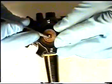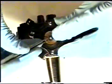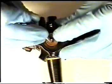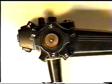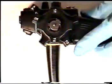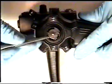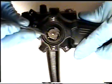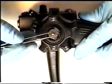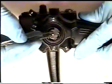If for any reason the parts in here have popped out, you may need to reseat them by pulling off the copper top plate. Removing the copper top plate exposes the internal greased assembly. There is a locking pin. There are 2 copper springs and a tri-locking assembly that needs to be flush.